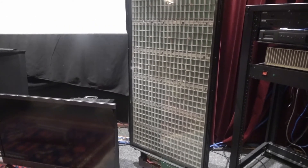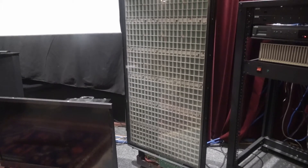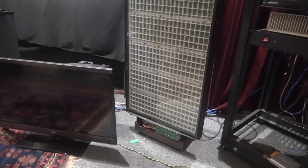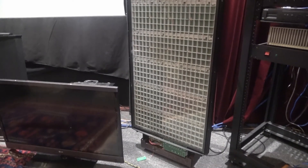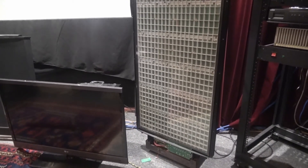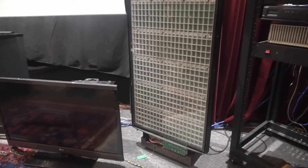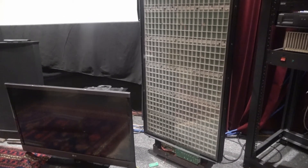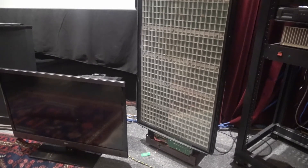So now it's been good. If it ever fails in the future, I'll just fix it like I have before — find out which panel it is. When I was investigating this intermittent dropout of sound, I was trying to locate which panel might have been doing it. There's a wire of EHT that goes up through all of them. I was disconnecting panel by panel, trying to find which panel was causing the RF emission to be picked up by the antenna, but I had no success. So I gave up.